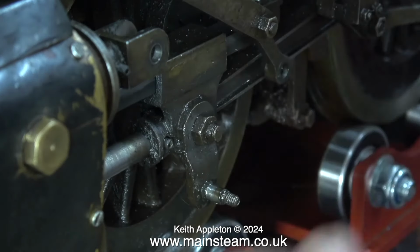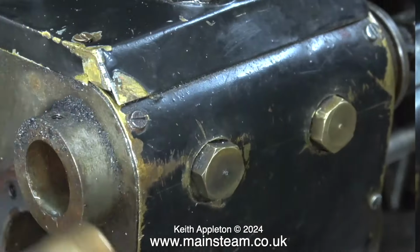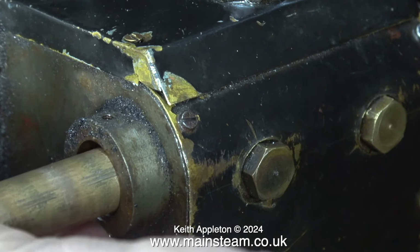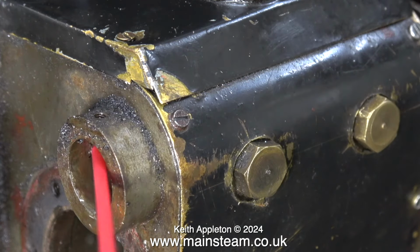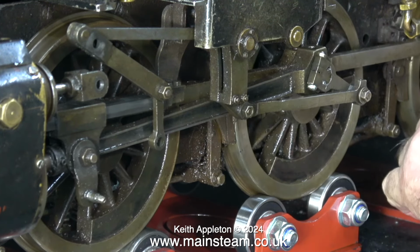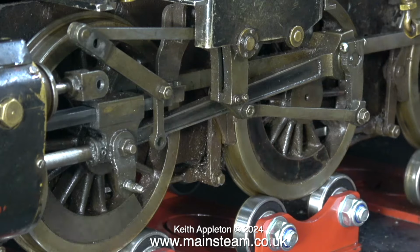You definitely do not want to sprain or break any parts of the valve gear, and some of the parts of these valve gears are surprisingly fragile. And now, using an even smaller piece of soft metal, I'm going to attempt to free off the valve. You will notice that I use lots of low velocity hammer blows on the piece of metal, which with the help of some WD-40 is just enough to free the rusted parts. And now I can almost rotate the wheels all the way around, but not quite. It still needs a bit more tapping on the piston.